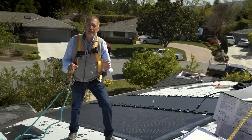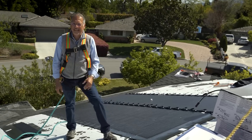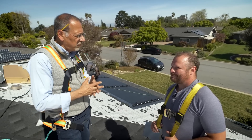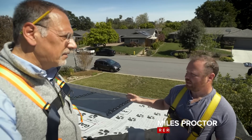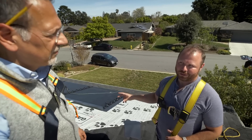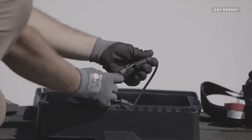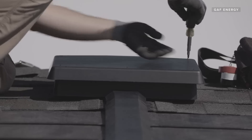Here's a house in Silicon Valley where they're actually doing an install of Timberline Solar — one of the first in the country. You've gone from being a roofer to a solar installer doing what you've always done. GAF has provided us with material that allows us to use our existing tools to nail down solar in a manner similar to shingles. When you're done laying them out, you pull in some wiring, fiberglass composite covers go on top of each of the wire harnesses, and everything drops in.